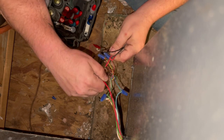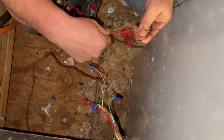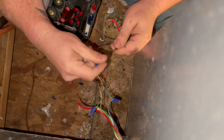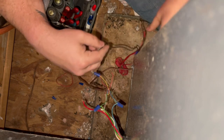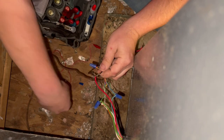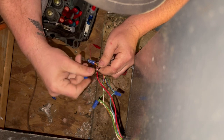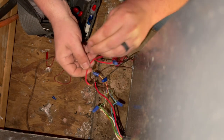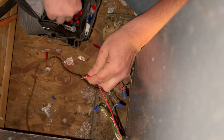We're going to unhook the pan switch from there, and unhook the other part from red. We're going to tie one of the red pan switch wires into one of the black SS2 wires — wiring them in series so that only one has to trip. Then we'll tie the other black wire here to the red thermostat wire. Then we're going to take the remaining red wire from the switch in the pan and go to the red wire that came with the air handler, and trim some of that excess wire.